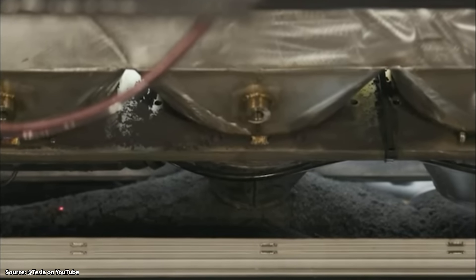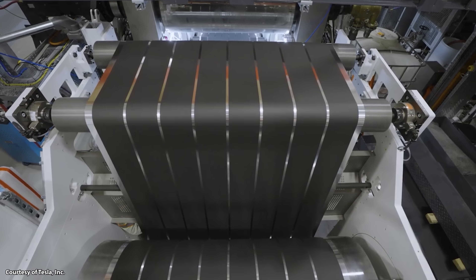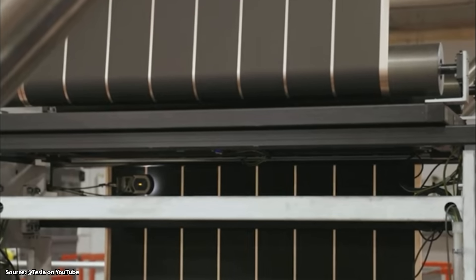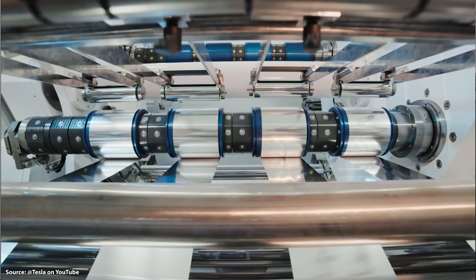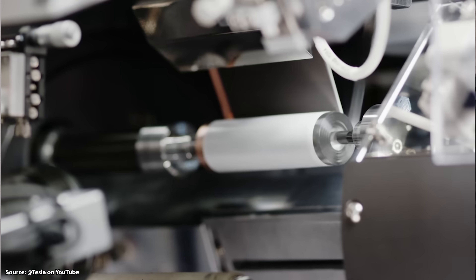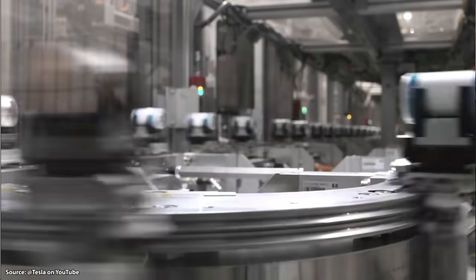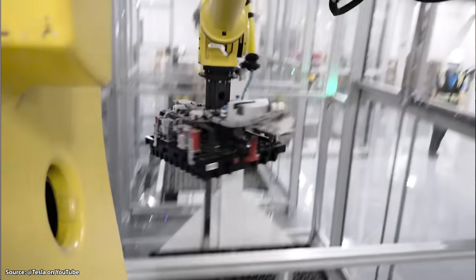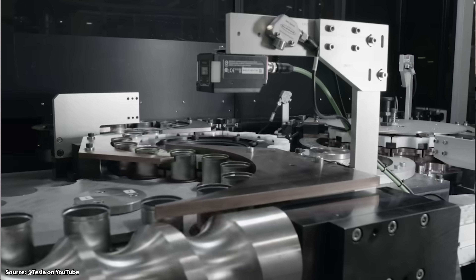In addition, in the absence of solvents, binding the hard cathode particles with dry polymers like PTFE and attaching them evenly to the foil is very tricky without liquids to get an even dispersion. This can result in uneven thickness, poor adhesion, and even delamination during winding, which would of course lead to some of those high scrap rates.